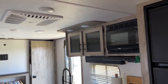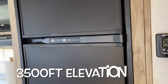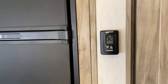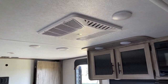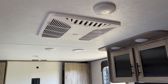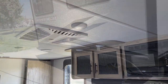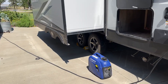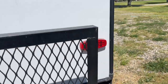It's kind of interesting that it's that close. At about 3,500 MSL you have the density altitude and it puts us at like 5,500 at least. The Westinghouse iGen 2500 will actually run this Coleman Mach series 15,000 BTU in a pinch — no soft start. We just did an iGen 2500 test running the 15,000 Mach Series Coleman air conditioner in a 26 DBHL double bunkhouse limited.